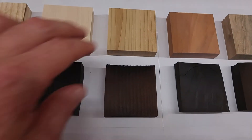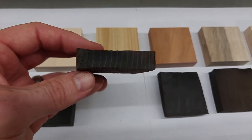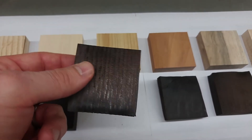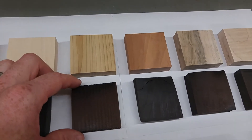Cedar was another surprise — a softer wood that held up okay. When it came out of the oven you can see it has some shrinkage in the middle, and again the growth rings are running that way so that's really where you'd expect that to happen. It still feels solid though, and I think that would be a usable piece of wood once flattened out.